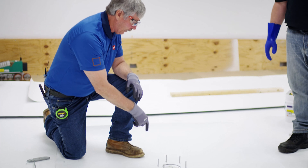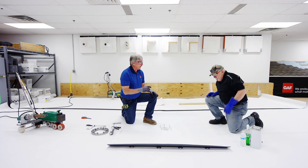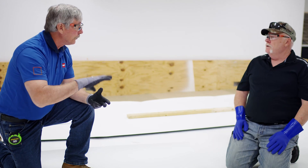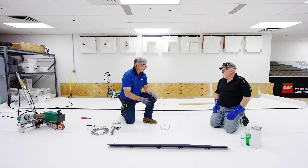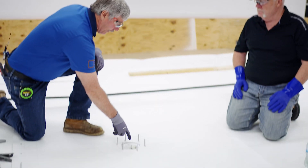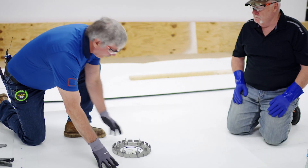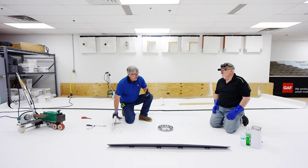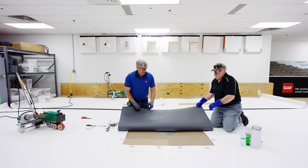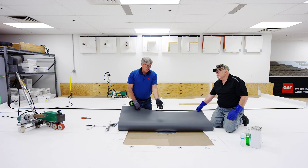We've got our target on. We want to talk about cutting the hole for the drain itself. We want to be at least an inch away from those bolts — we don't want it wrapped tight, but we also don't want it so small that it constricts the water flow, because there are calculations for how much water has to flow down through a line of these drains. Use the rag to stuff down in there — don't drop anything down the drain, and pull it out when you're done. Once we've got it cut, install the clamp ring — it's pretty much just a matter of bolting it down. Someone might ask: do I need water block underneath the clamp ring? No. Because if you get water underneath that, you've got bigger problems. Plus, you're putting water block on top of the substrate which isn't very waterproof anyway.